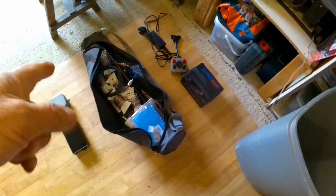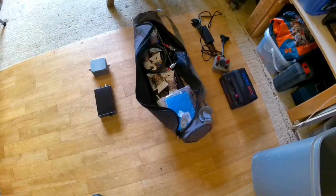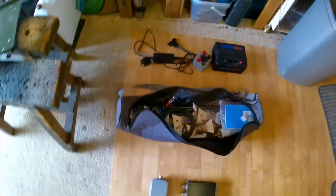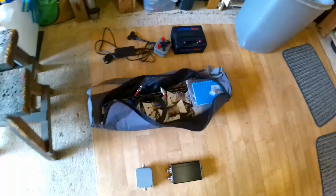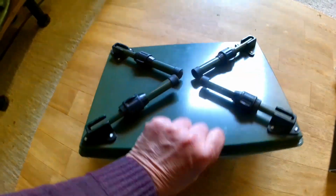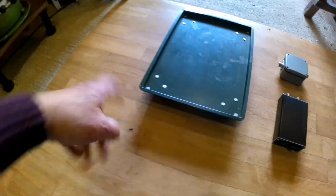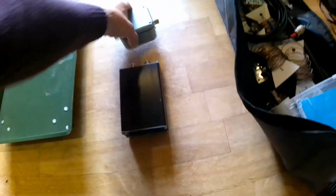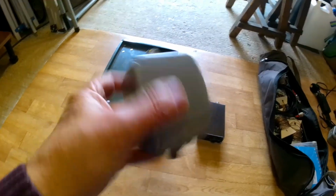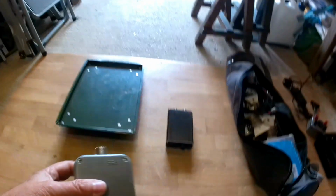Now I've got my extra coax cable in there. I've redone the end, soldered the connectors on the end, just to make sure I've redone them. Now additions I might take for QRP operation when I'm out portable is a fold-up bivvy table, a fold-up stool which is about the similar size. I've got the options of taking the choke, stopping the RF coming down the cable. That gives me the addition of being able to run an extra cable if need be.